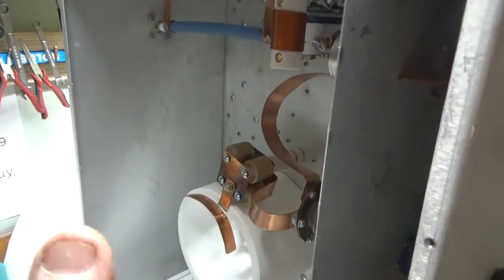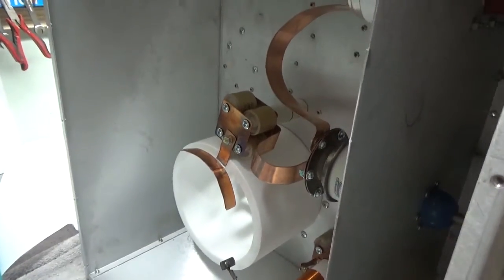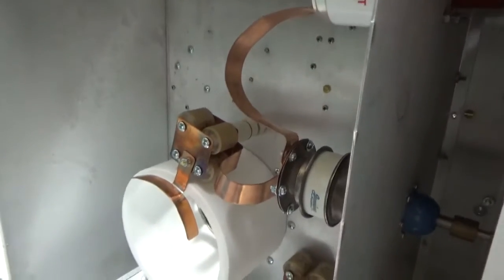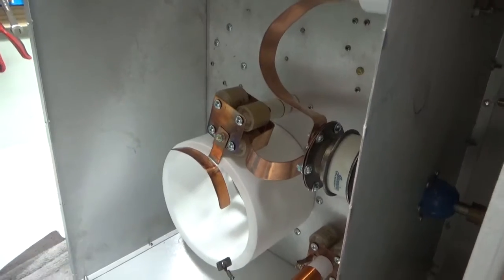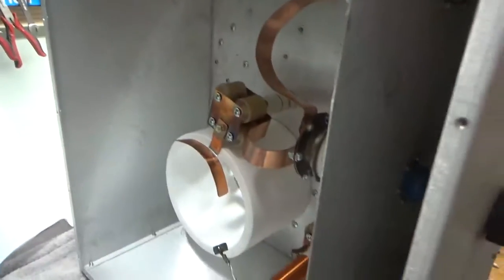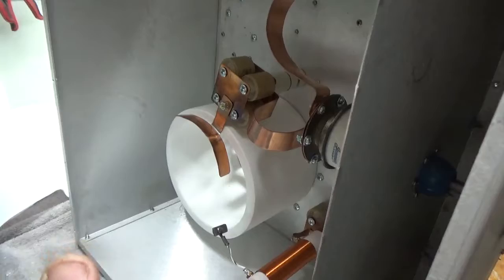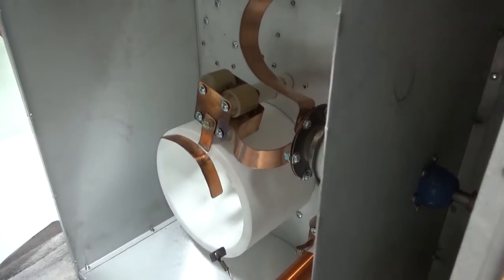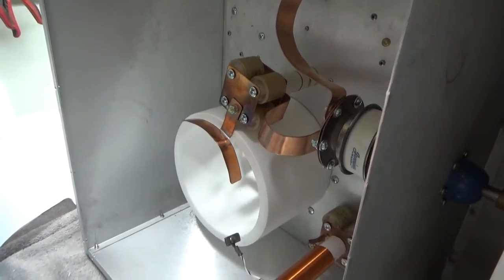I didn't opt for a chimney on the top — that's not needed in a situation like this. They did that with amplifiers with roller inductors to give the inductors cooling, but I wouldn't be able to work on it with the cover off, and it's just not needed. I'll have one perforated cover with plenty of airflow. They also do that in some amplifiers that aren't using a proper blower — compensating when the blower doesn't have the proper pressure rating.